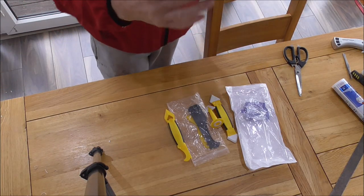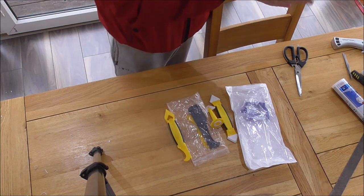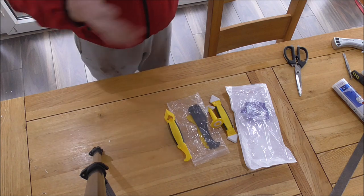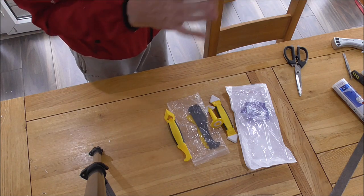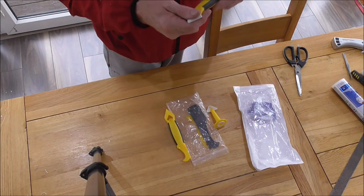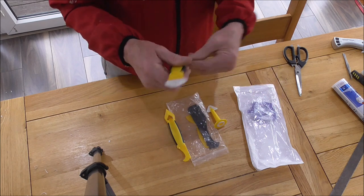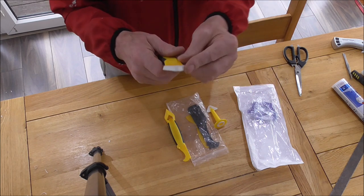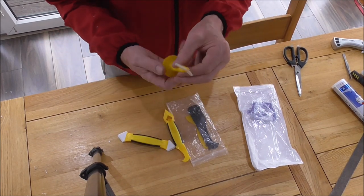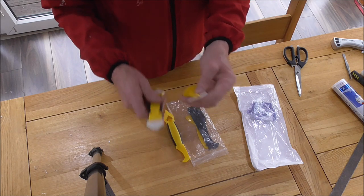Now, when siliconing around edges, usually I don't use any fancy gadgets, I just use my finger and some washing up liquid, nice and easy. But round here, I don't want to be going around with any kind of washing up liquids and stuff afterwards. So, I've got this kit, which I use on other jobs like this. And it's just a spreader, is this one. Gives me the curvature that I want and leaves it reasonably clean. And then the applicator, which puts it already pretty much to where I want it to be. And then I just go around and finish it.